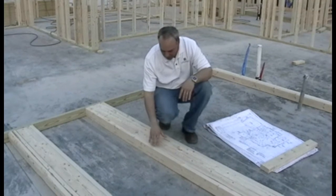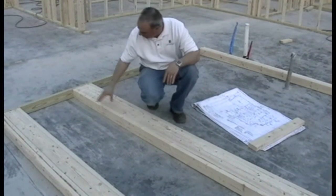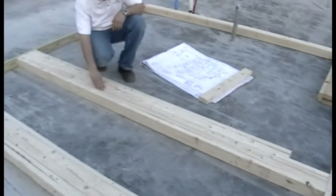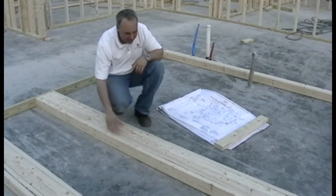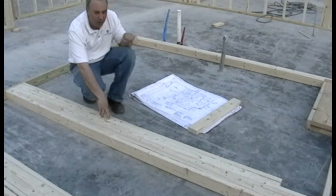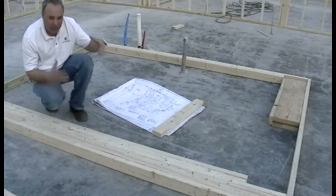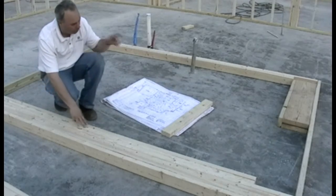The basic construction material is called a stud, which is this item right here, which goes from the bottom plate to the top plate. This item right here is called a corner. That's where another wall will come up and it'll marry right here to this wall and they'll be joined at the top. These two items here are called jacks and they sit underneath headers which hold up the opening. So the header is a support for the entire structure in the wall in the framing section. So the jacks will hold the headers up.